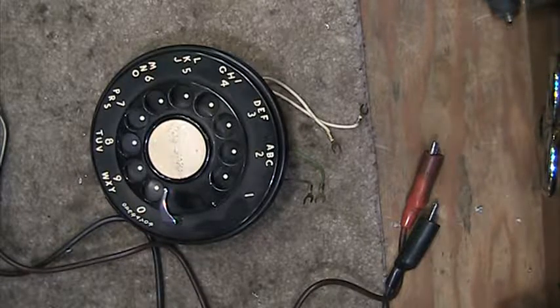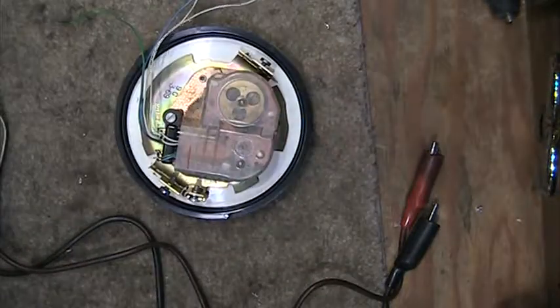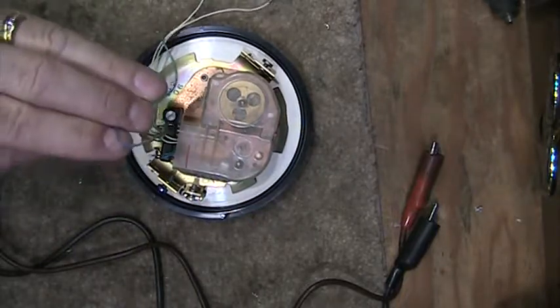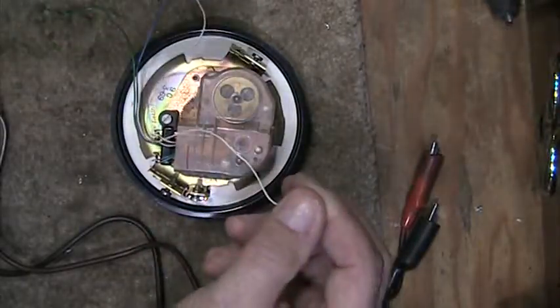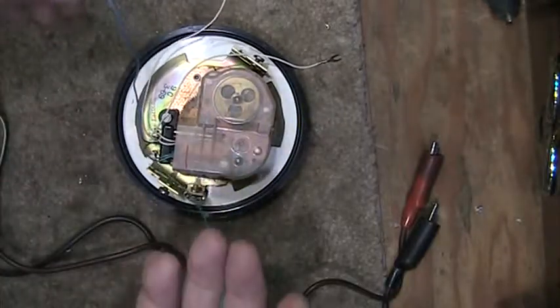This is a demonstration of how simple a dial is. So if the contacts on the back of the dial — and I will use a number 9 type dial, here's a number 9 dial — I have a blue and green and two whites. Same exact concept. This is a switch to short the receiver. This is the switch to open and close the phone line.